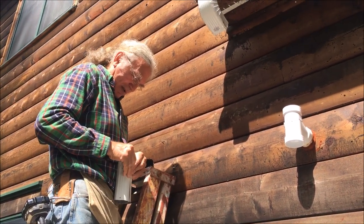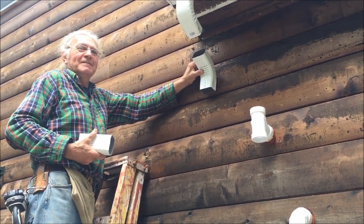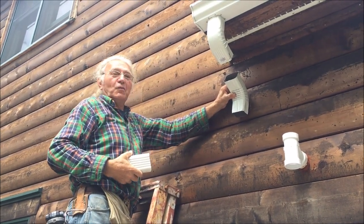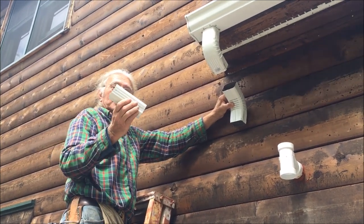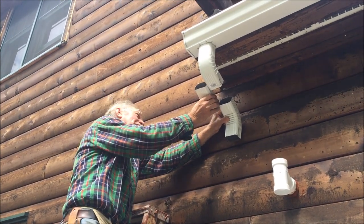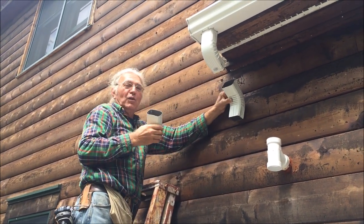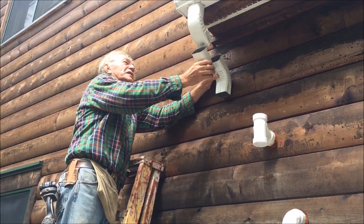And sometimes the downspouts come apart. Rolling. So I put this one tailpiece in, this one elbow in. It's a 45 elbow. And then I put the other one against the wall and measured the distance between them, which is roughly 3.5 inches. And I cut a piece of downspout about 6 inches. So when I install it, there'll be about 1.5 inches, or, give or take, about 3/4 inch overlap, something like that. That way the lower elbow is tight against the building, and there's enough room when you're putting these together